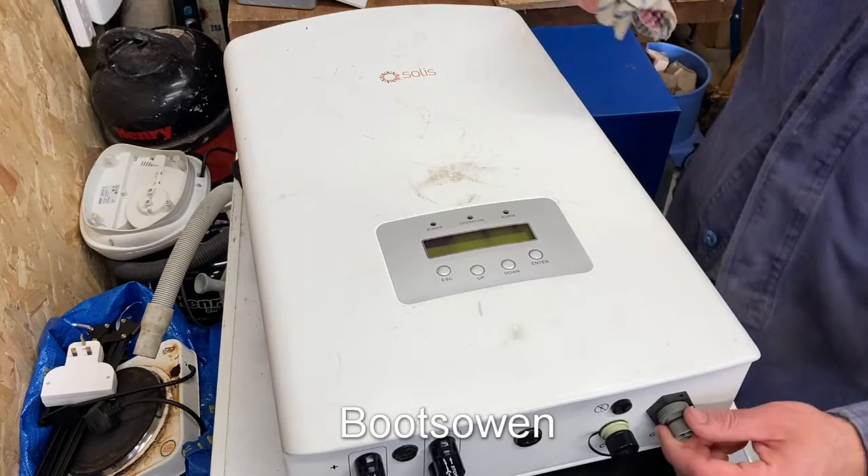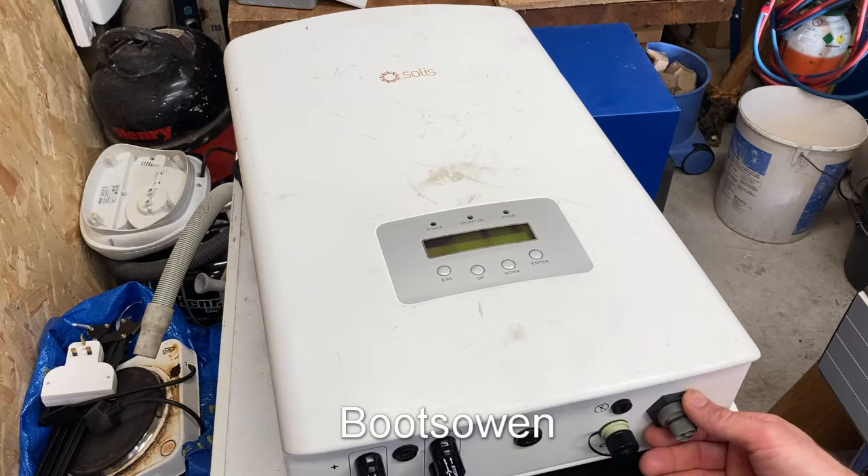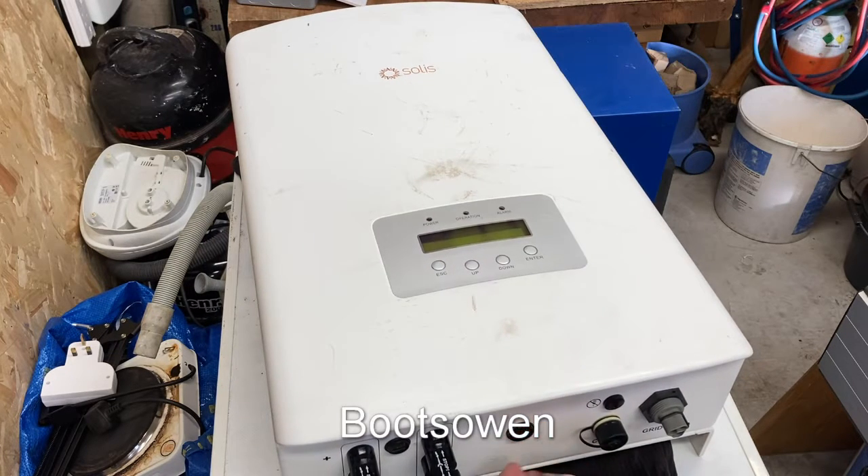It has a weird plug on the base — I'll show you in a minute. There it is, you can see it. It's got a name, I can't remember what it is, but it's no good to me. So I need to put a gland on there — and there's a data or com port in here too. So I need to put a gland on a bit of cable, 13-amp something, just to bring it back to the mains so I can test it. It's got two DC inputs down here — I'll only need one of them. I've got a string of five panels, a couple of hundred volts, which should fire it up. Oh, it's got a fuse hole here — we'll have a look in there.